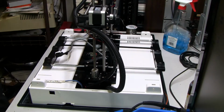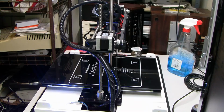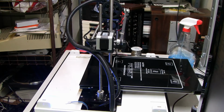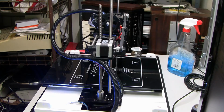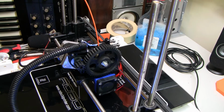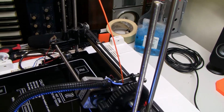I still didn't have that by the end of this video. I ran the calibration. Well, first I homed it, which worked beautifully. I was shocked that it hit every single switch without colliding or snagging. It was pretty unlikely. I didn't really understand until this point why there are two Z switches, but it's actually a little cantilever system that helps it do auto bed leveling.